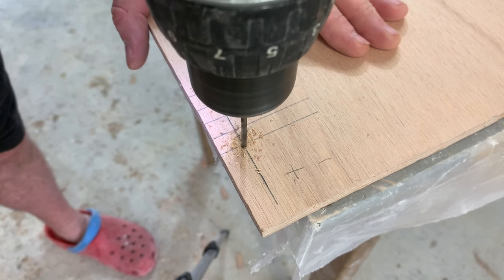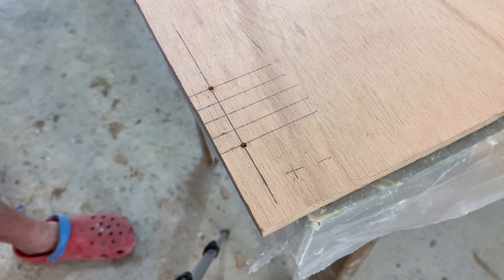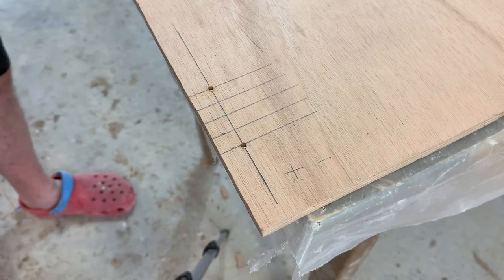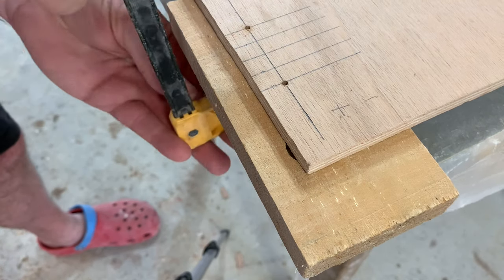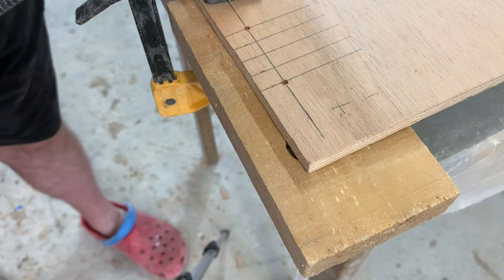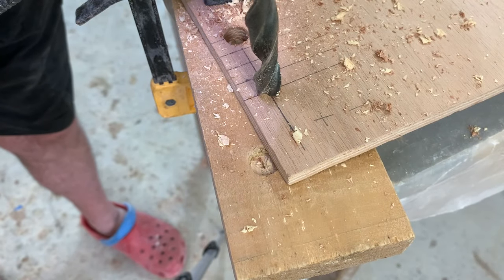The material is so soft it's easy to go. 13 millimeters a little bit in. And it tends to rattle around in the soft surface. What I should really do is pop this into my drill press, and at least that'll stop the drill from wriggling around and trying to create a triangular hole. But it's okay, we don't need to fuss too much about just how beautifully that is drilled right now. This block helps to prevent a bit of tear out at the bottom.